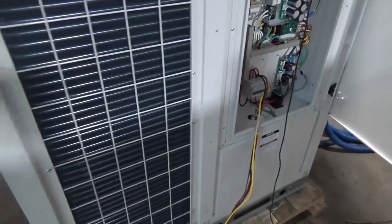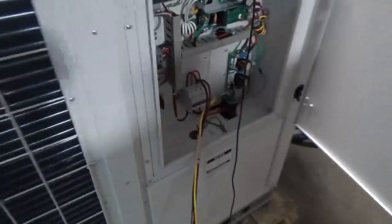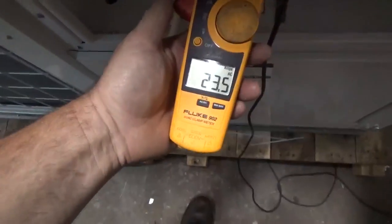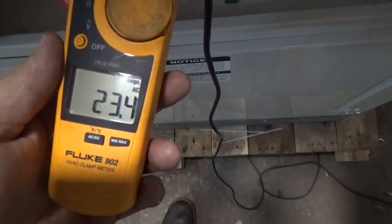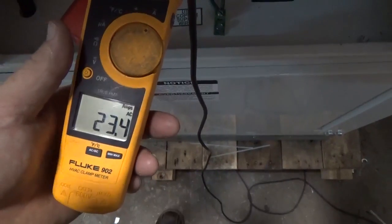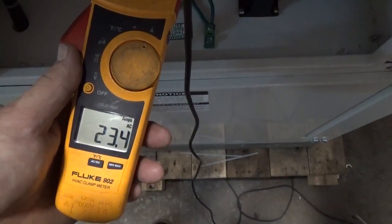The reason I'm so excited is that on most homes we're trying to take off grid with heat pumps, we can't run them — they have locking rotor amps over 100 on 230-240 volts, impossible to run on some of these smaller battery backup systems. But this unit has basically a locking rotor amp of nothing because it's a variable speed compressor. Here you see 23 amps — this thing is running full-bore making chilled water and heat. I can run this off an Outback Radian or a Schneider Electric 6000-watt inverter.